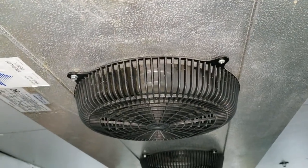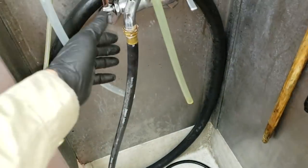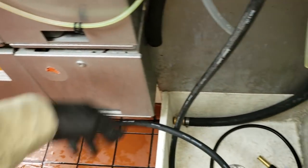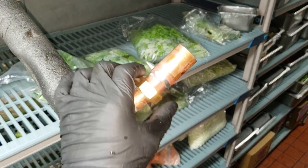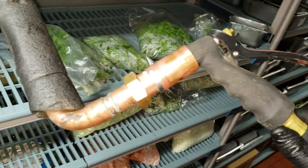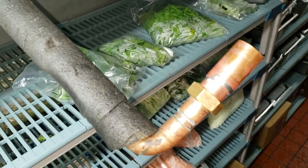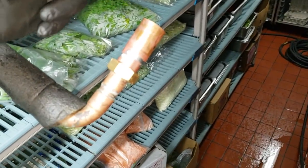So we're going to blow this thing out. Taking my water hose, always being conscious of the customer — running it in a fashion that it's not going to be in their way — and putting a drip loop in the mop sink so that if this leaks, which they always do, it doesn't run down and make a mess; it'll drip into the mop sink instead. To start, I already had a union here, so I undid the union and welded on a one-inch coupling, because this hose fitting will fit right in there nice and snug. I can tape it up with electrical tape and pressurize the line really well to make sure I clear it all out. Once I pressurize this, I have to make sure it doesn't start coming out into the walk-in freezer. I can slowly turn the hose bib on, let it push, then go out and look at the drain to see what's coming out.